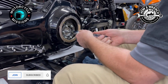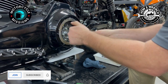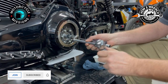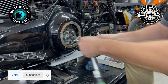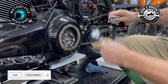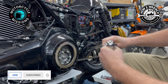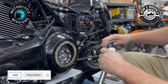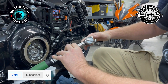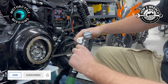I want to make sure I'm on my adjuster screw, then I can slip my crow's foot on here to give me workable room. Here's the important part of using a torque wrench with adapters: anytime we use an adapter, we want to use it at 90 degrees to cancel out the leverage differences because of the adapter. If I position it anywhere else, I've effectively changed the length of the torque wrench.